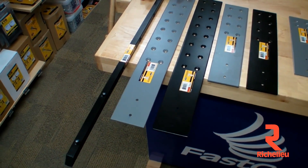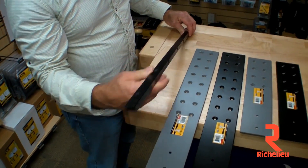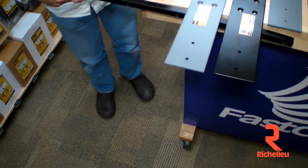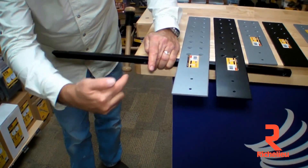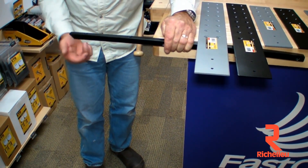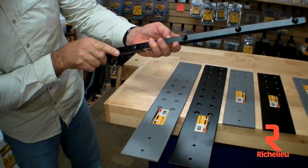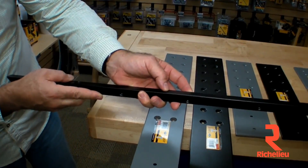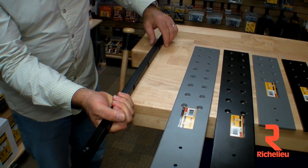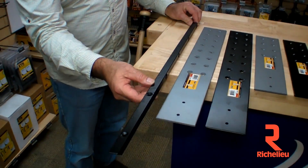Then we have this one, and I love this one. This was developed by a granite countertop guy. Basically, it's a solid piece of three-quarter-inch steel that allows you to go into the cabinet. You would screw these screws into the cabinet onto the side panel, leaving this part overhanging. If you have a substrate, you can screw in from here and here. We've countersunk the holes on both sides, so it works on the left panel or the right panel. This is great for granite countertop installation when you have no interior supports on top of the cabinet — it can be screwed to the side wall. This is the new 30-inch solid steel Stealth Speed Brace.